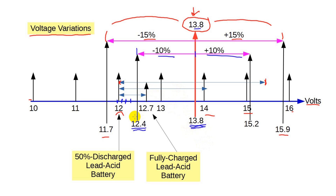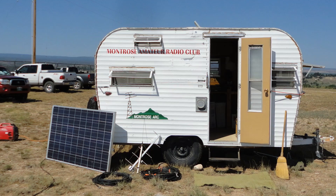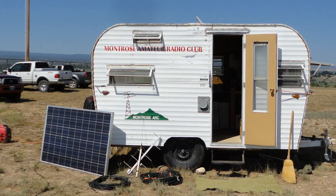I had to raise the voltage if I wanted to continue using the 3000 on solar. I needed a voltage booster. There are two major ones I know of on the market: the MFJ4416 and the TGE-N8XJK — both booster-type regulators that add enough to the input voltage to put out a nice steady 13.8 volts DC. I purchased the TGE model; our club has the MFJ model in the club's emergency deployment trailer. Both work wonderfully. My 3000 is now super reliable, and during our club field day, our 20-meter station works well on the battery, particularly during the day when the sun shines on the club's solar panel.